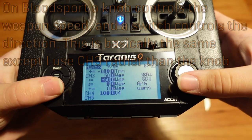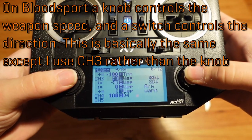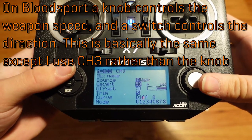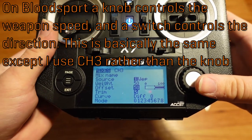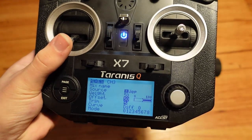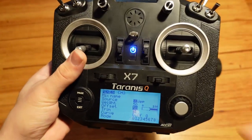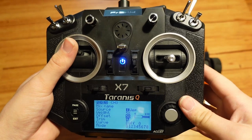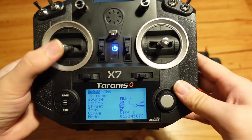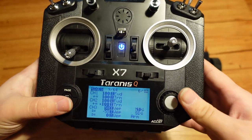The 50 shown there is just the weight. If I go into this, you can see it's an offset of 50 and a weight of 50. That offset of 50 is to make it so that it starts at the middle position instead of starting at zero, because otherwise it would go from full reverse all the way up to stopped, instead of being stopped to full forward.